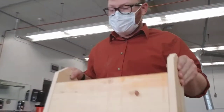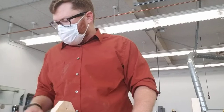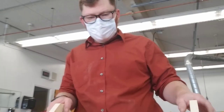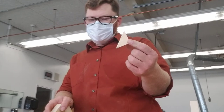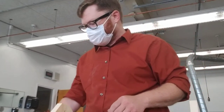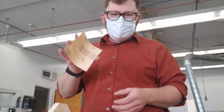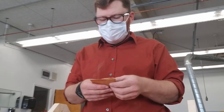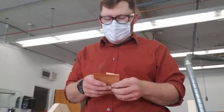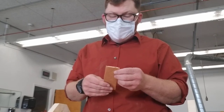The box is ready for sanding. You definitely want to sand before you put your rope handle in. We've got two different pieces of sandpaper here, and I want to sand this whole box. What I want to do is take my quarter sheet of sandpaper — this is one-fourth of the full-size piece — and I'm going to fold it in exactly thirds. The reason we do that is so that when we're sanding, the paper lasts longer. It's more efficient.